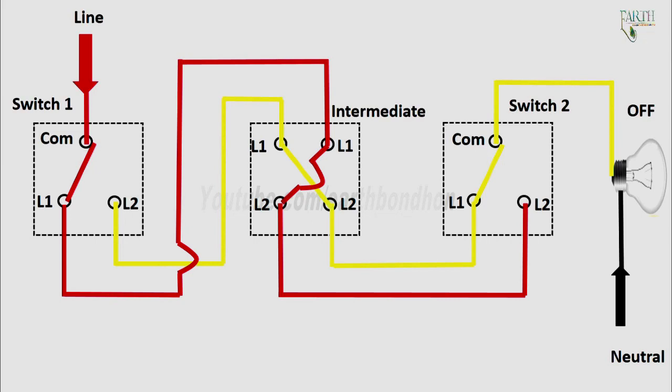This is due to the fact that three-way and four-way switches are wired in series by a pair of conductors known as travelers. The first and last switches in the series are three-way, and all others in between are four-way. In other words, if a person wanted a hundred switches to control a light, then two of those switches would be three-way and the remaining ninety-eight switches would be four-way.